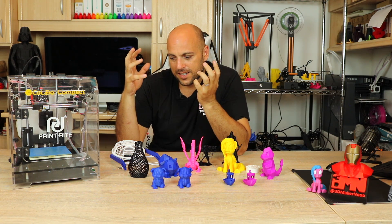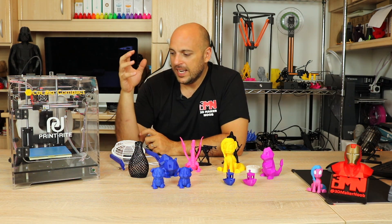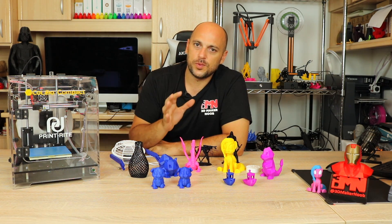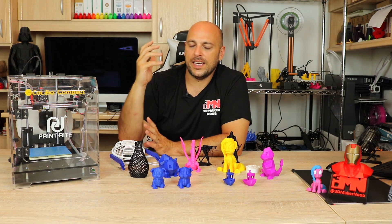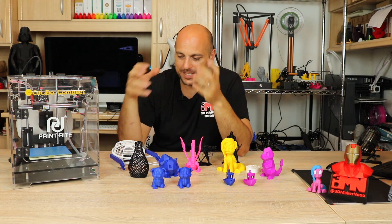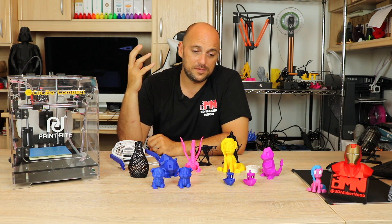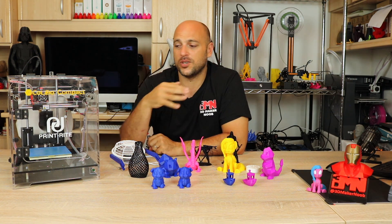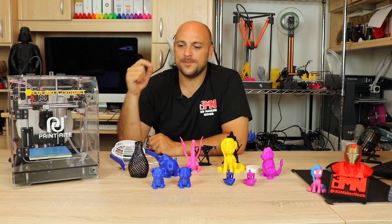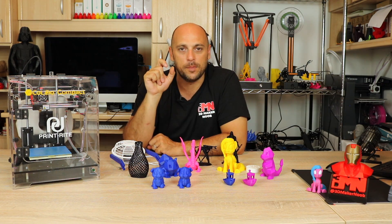However, there are unfortunately many things I don't like about this printer. The heat bed is something I've made my peace with — it's not something I find necessary when printing just PLA. Not having an LCD screen is something I particularly don't like. I don't like printing via tethering because if there's an update or something goes wrong with the laptop, that's it — your print is ruined, as has happened to me. Also, using the SD card means you can only hold one file on it at a time because it has to be the same file name each time.